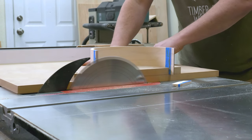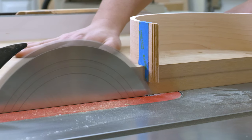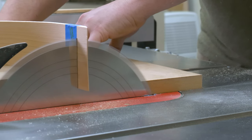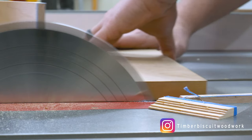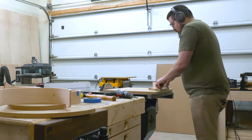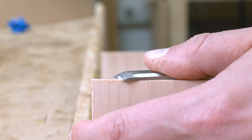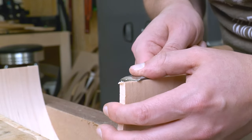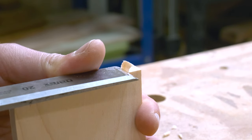When removing the piece from the form I had to be really careful not to snap off my offcuts and risk breaking the lamination. The blue painter's tape was also a great indicator for lining up the second cut. Not all the table saw cuts were perfect, so I used a chisel to clean those up — taking light passes to avoid tear-out, just paring away so I don't take deep gouging cuts.